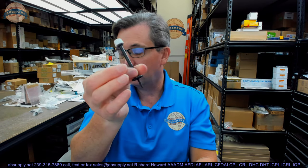Very typical, very common — mounted on the baseboard, occasionally on the door at the bottom. Even sometimes I have seen it attached at the top, and the reason for that is you have a kitchen door that swings in, with cabinets up here from the wall and a counter top down here. When the door gets to about 95 degrees it is going to hit those cabinets, so they attach it right at the top of the door so it will hit the side of the cabinet. Wherever you end up placing it is where it will be effective.